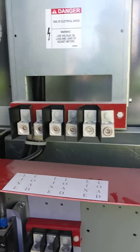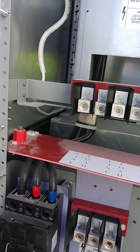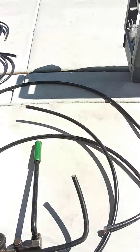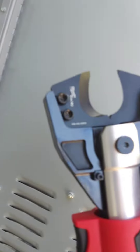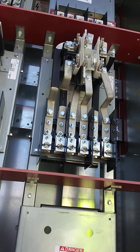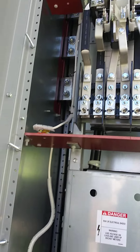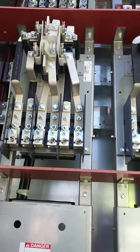Actually they're going to be in a worse shape because by then nobody right now is open, so they're going to have to shut down all the suites when they get to doing this. But we're ready though — we got our wire bender, torque wrenches, sound block, and cable cutters, so we're all set. Even though we have everything to do it live, we're going to do a shutdown because nobody's open for business right now. This building is fairly new, so it's going to make it easy for us, and at least we're helping the next guy by giving them a provision for the neutral that goes up to the meter sockets.